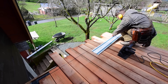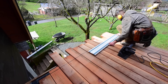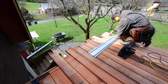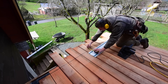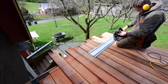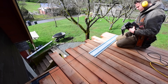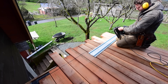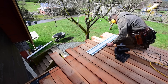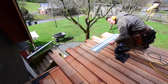Pretty simple process. This is where my decking is gonna get cut, so I'm simply gonna mark about three-eighths of an inch away from that line. I'm gonna set my saw to about 35 degrees — it'll just be able to get through inch and a half material at around 35 degrees. Drop my depth. Set my track guide three-eighths of an inch away.